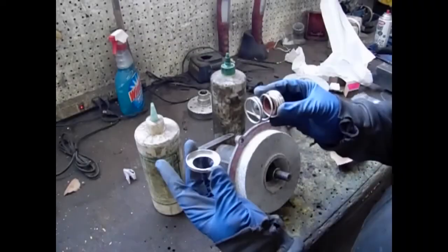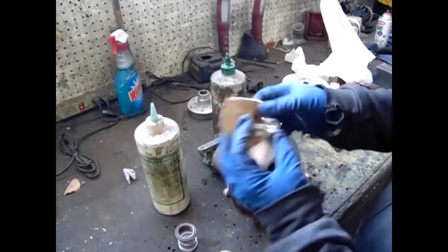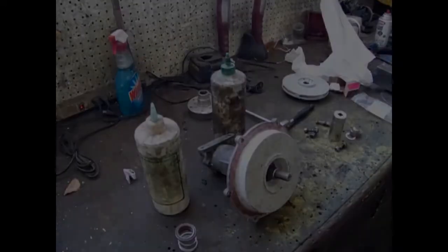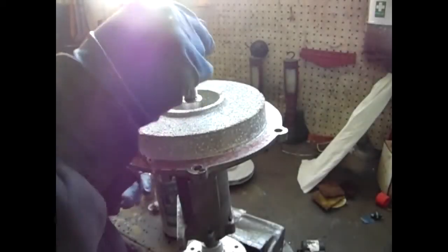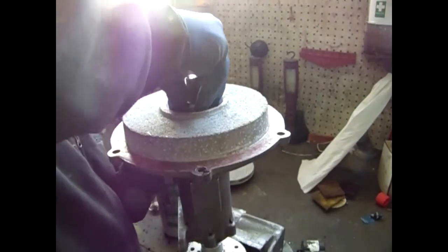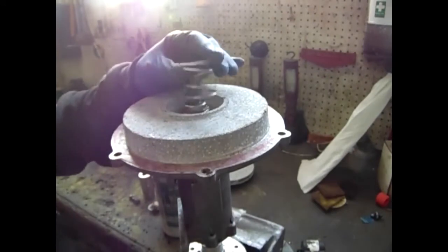The seal kit will likely provide a cupped stainless steel washer over the spring. Remove the washer and discard. With the backplate, seal, and body assembled together, you can now press on the rotary seal. Ensure that both sealing surfaces are perfectly clean and dry. Press the seal down gently and smoothly until it is seated.